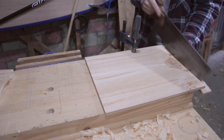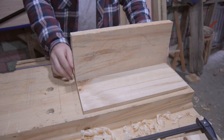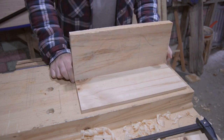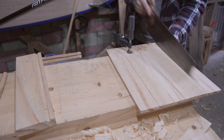And the stop dado is the same depth as the groove on the sides and the ends, so I was now able to use the handle to mark out the width of the panel at the bottom. And you use the same process to figure out the width. Of course, I did it in a really roundabout long way, but you'll figure it out.